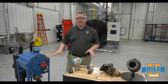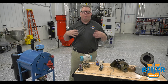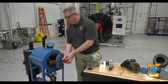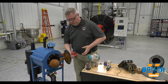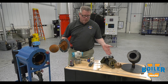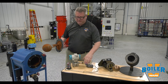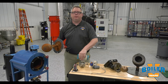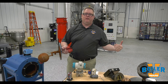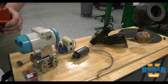On the boiler tips for the next few weeks, we're going to look at a variety of types of level controls. We're going to look at the full gamut from mechanical floats to probe types, electro-mechanical, all-in-one, low water cutoff devices, and even differential pressure transmitters. Basically what we're going to do is go through each of these — how they work, what their applications are, and in many cases how they're wired.